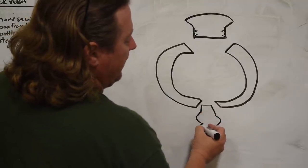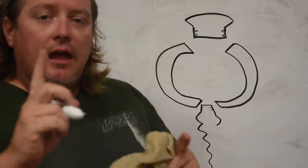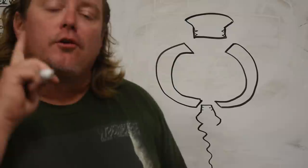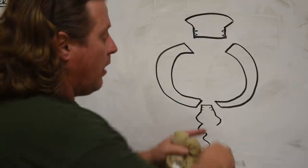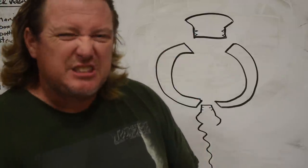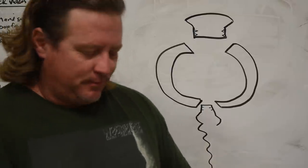And we'll do all our decorations and stuff right there. We'll cut the recesses on that one too. And then we would do the top piece. The reason why we're doing that one is we want to have continuous grain flowing from the base to the top. Just a little nice touch. So let's head over to the lathe and turn a quick spindle.